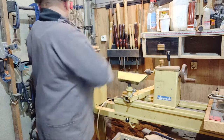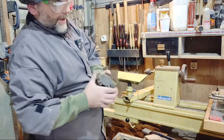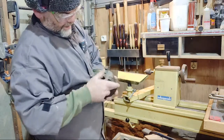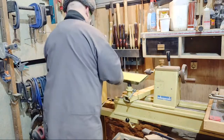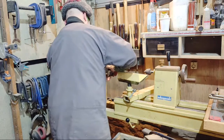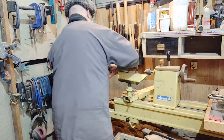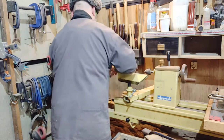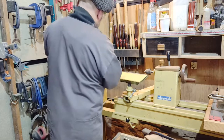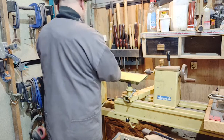But we're going to be using this chuck here, whatever it is, it's a Rohm, R O H M. It should say on there somewhere. Can't see it now. Right. So let's screw that on there. This can be a bit finicky. Doesn't like going on. Yeah, it's going. It's on. Yay! And then there's a grub screw inside here. And you have to do them up as well. Otherwise it keeps tightening and tightening, which makes it hard to get off.